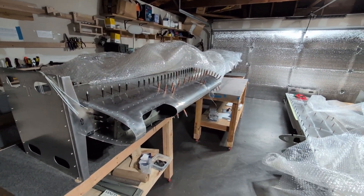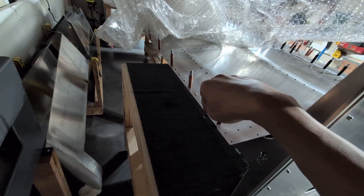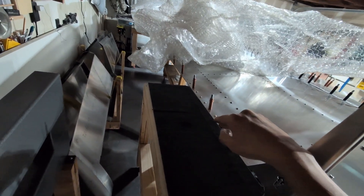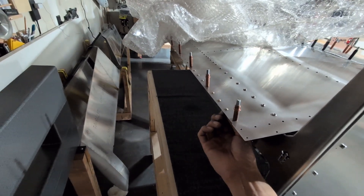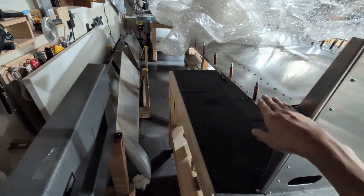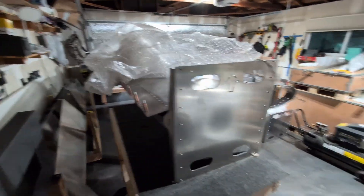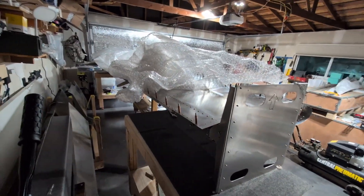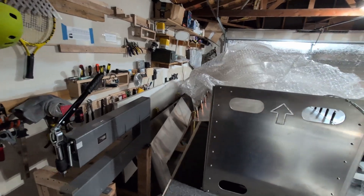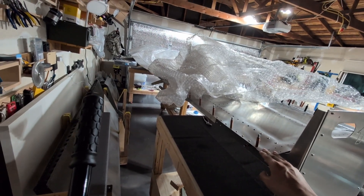The next step for me is to primarily focus on the right wing. Once I replace the leading edge, I'll probably start working on the trailing edge — I have an entire row of solid rivets to do. Sling actually shipped regular pop rivets for those, but based on other builders' experience, people generally swap those out for solid rivets to provide better clearance between the wing surface and the control surfaces like the aileron and flap. I plan to do that. I have my air compressor and pneumatic squeezer, I just haven't had the chance to set them up yet.